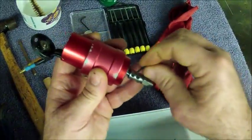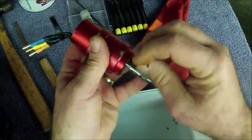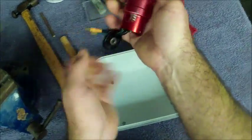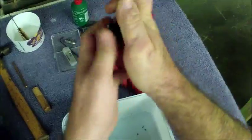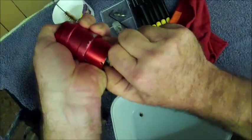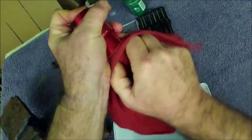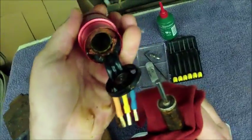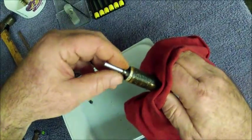I'm going to loosen up our coupler now and take that off. Now it's a bit of a challenge to get your rotor out because you've actually got the magnets around the inside retaining it. Turn the motor vertical, push down with either thumb, grab the rotor with your two fingers and pull really hard. Also remember that there are spacers on the opposite side of the rotor. Pull really hard and out it comes. There you can see our spacers — make sure that inside you don't have any spacers hanging around. Knock it out inside your container and take them off.